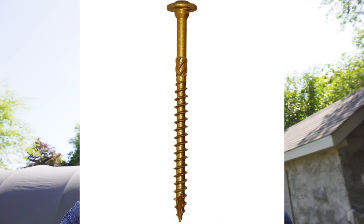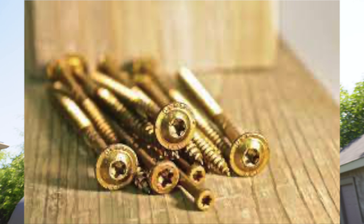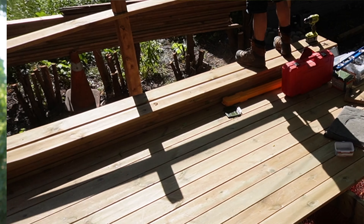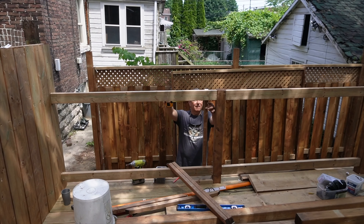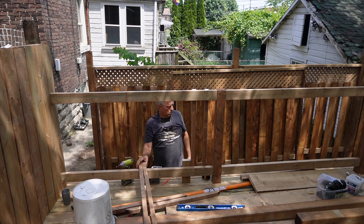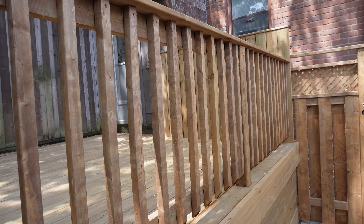When it comes to the railing on the perimeter of the deck, we inset posts into the framing of the deck and used big structural T30 screws to hold them in place. The T30 GRK screws have been one of the greatest innovations when it comes to structural screws — I think they're way better than lag bolts or carriage bolts. These T30 Torx head structural outdoor-rated screws are beautiful for this application. We routed the square hole in each deck board, the post slides right into the structure, and it all looks nice and seamless. For the railing we did a simple 2x4 top and bottom stretchers and then classic square pressure treated pickets with a deck board on top to keep the look clean and simple. A lot of times I find clean simple designs are underrated.